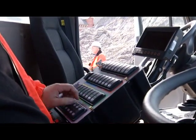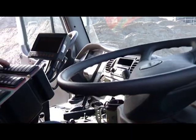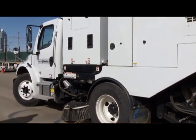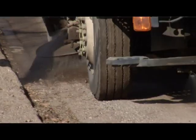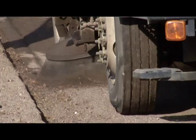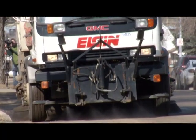What we have on our sweepers — it's not a requirement everywhere — but the cab itself is actually pressurized so that no dust is able to come into the cab for the operator. That's important; he's not exposed to dust constantly, and it makes for a good, safe work environment. The other thing is on all sweepers we use water as a dust suppressant. There are spray bars on the sweeper that go down onto the material on the ground to keep the dust down when you're sweeping — the last thing you want is a huge cloud of dust following the sweeper.